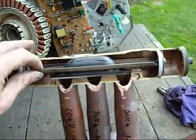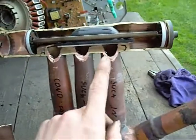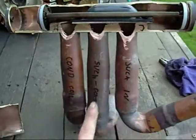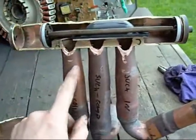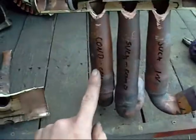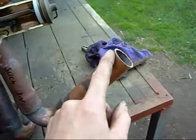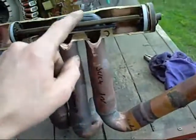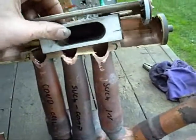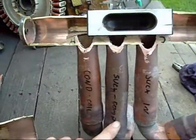If I were to slide this across, this will change it to cool mode, where low temperature gas from the interior unit is siphoned into the compressor. High temperature gas comes out through the high temperature tube on the compressor, down to the condensing coil where it is condensed back into a liquid, and continues the cycle back to here — through this little chamber and back into the compressor in gas form.